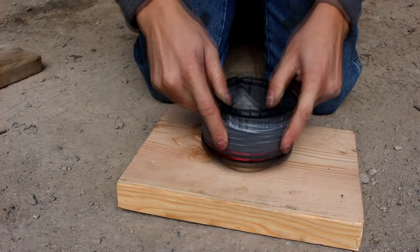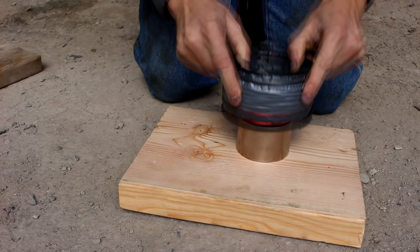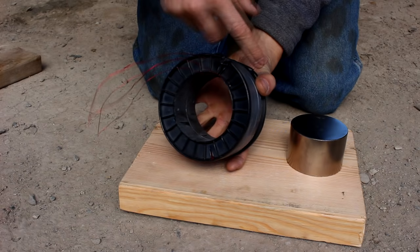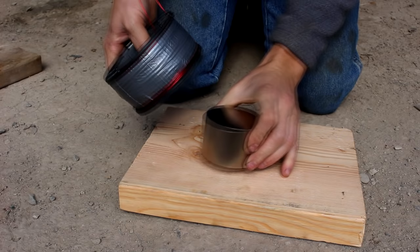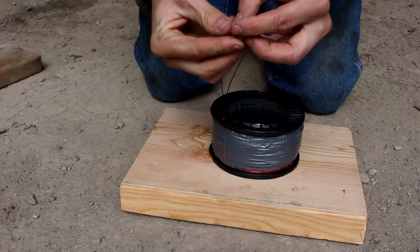You can see the magnet glides in and out of the coil pretty easily. But now, if I short out the winding, you can see the magnet is reluctant to move inside this coil. That's because the copper wire does not like it when the magnetic field changes, so it creates an electric current which creates its own magnetic field to counteract the changing magnetic field, and that causes a resistance to the motion of the big magnet.